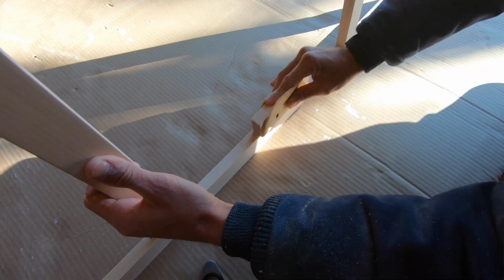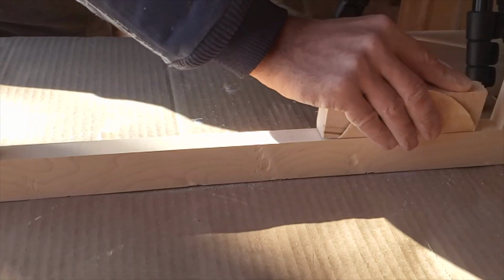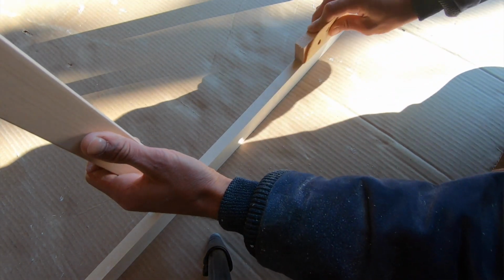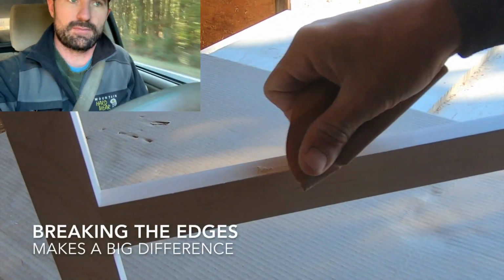And I might add that it is really cold today, so I'm hoping we don't have any issues lacquering the trim and base frames of these cabinets, because that would hold up our assembly time. We typically like to build and sand the face frames before we install the cabinet box parts to the face frame, so that we don't have to mask off our pre-finished plywood. We can just assemble it and be done, and then it'll be ready to install. So I'm hoping all goes well.